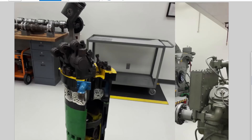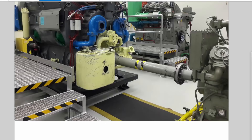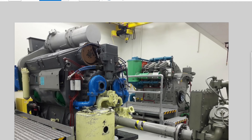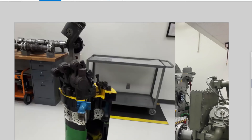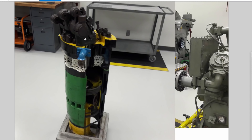Here is an EMD power assembly that's been cut open. You have a cylinder head with all of the cams and rockers on top, then the liner — the actual water-cooled cylinder walls — and your piston inside with a connecting rod going down. These individual power assemblies, also called power packs or HLPs (headliner pistons), can actually be replaced as a whole unit in the engine. The block is just a case for those. Rather than changing engines when time comes, they typically just change the power assemblies out.